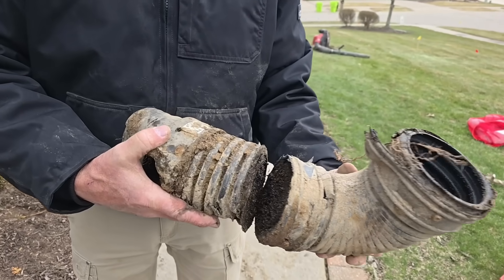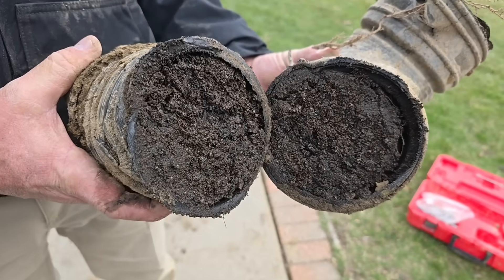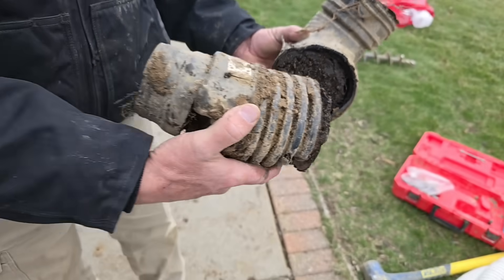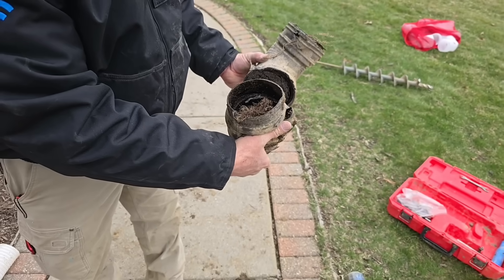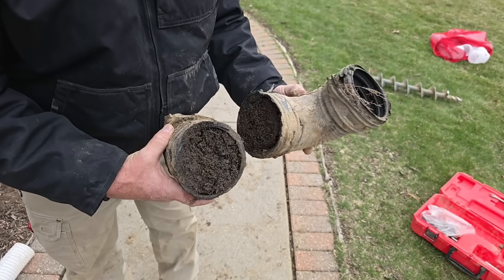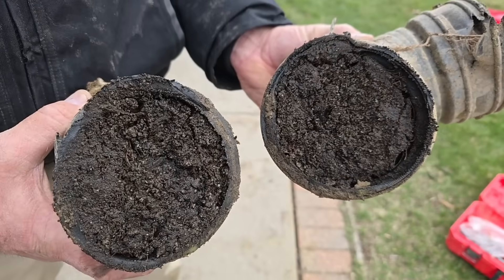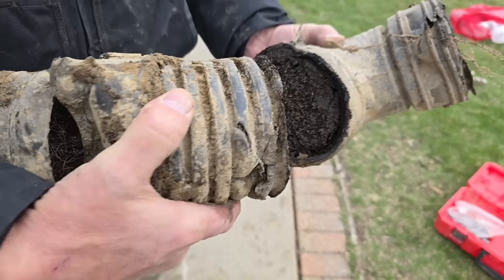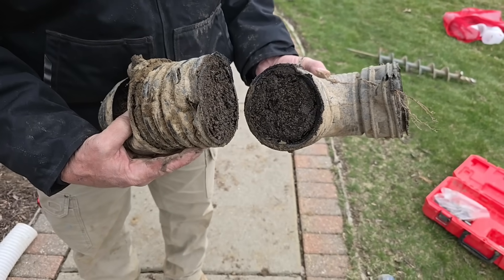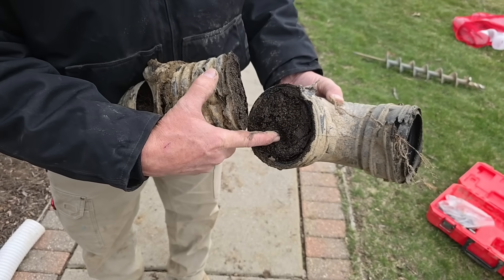Dirk just cut this open so we can show you what's inside — roots and shingle gravel. This is exactly what happens when you don't tape all your connections, you don't have a leaf filter to filter out the organics, and you don't have a catch basin to catch the shingle gravel. The shingle gravel got caught up in the leaves and the roots. So you need a leaf filter and you need to tape it. On a two-by-three, the shingle gravel in a smaller diameter pipe will travel all the way down to the sediment trap.